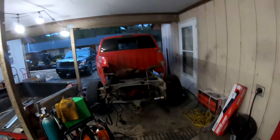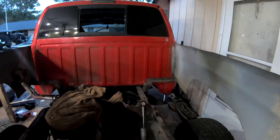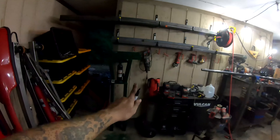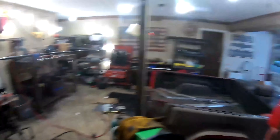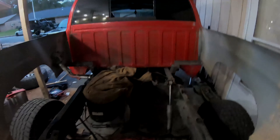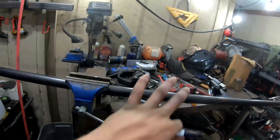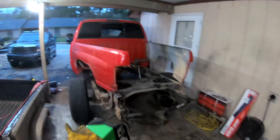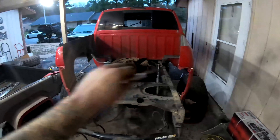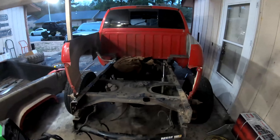Once those lights are there, it's gonna look really snazzy. So I went ahead and put back in the fuel filler, and now I'm gonna start the tube work. I don't have a tube bender here — I've got my pipe kinker that works for small things, but it's not pretty. So I don't feel like adding a bunch of ugly kinks in this inch and a half. Instead, I'll use 90s and different angles with my tube notcher, and do some straight 90s in the back, straight horizontal, and then a nice little cross in the front. Leave it all notched and minimize the amount of bends I actually need to do.